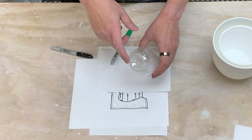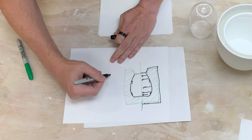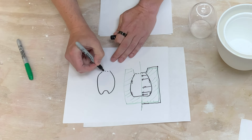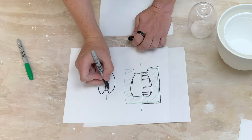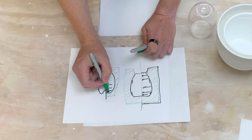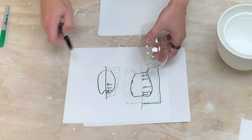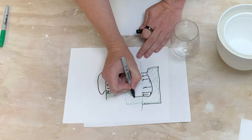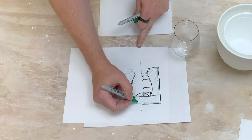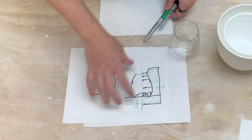The problem with a lateral split is the concave bottom — this is actually concave right here, it dips in. So we can't pull from that direction because plaster would be in the way. It may have been a three-piece mold: one lateral cut and another cut for the bottom piece. But do we really need a three-piece mold? I don't think so — we have another option.